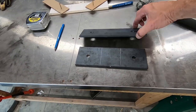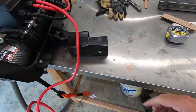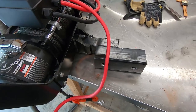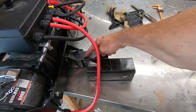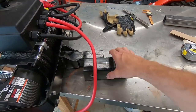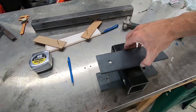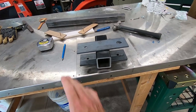So these pieces here — this is quarter-inch stock, quarter-inch by three. I've got this piece of two-and-a-half-inch receiver tube, and I'm going to cut it off. I want it to be as short as possible so everything stays as close to the tree as possible. I've figured out how far that receiver is going to slide in — I'll leave myself an extra quarter inch or so. I'll cut that off, and then this piece of receiver tube will get welded in between those plates. That's the basic structure, and then I'll build pivots that come off either side of that.